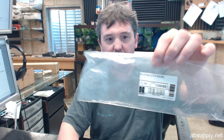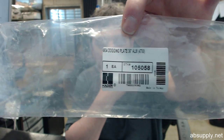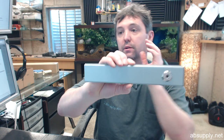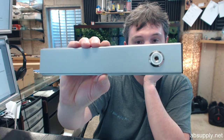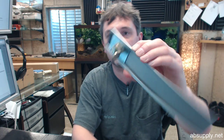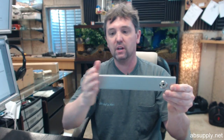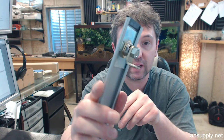Hello, my name is Rich Howard, owner of Architectural Builder Supply. This video is to bring you a closer look at the Hager 4934 ALM 36-inch non-fire-rated dogging plate for use with their 4700 series exit devices. This is the replacement cover plate that goes between the end cap on the hinge side and the push mechanism, which includes and incorporates the dogging mechanism as well.